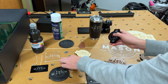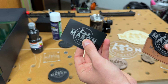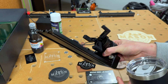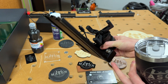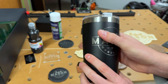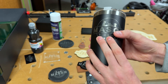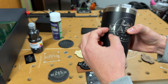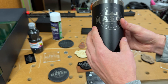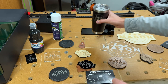Wrapping up some of the S1 examples — here's a metal business card. It has a coating, so you're basically removing that coating. The same applies using the rotary attachment: it's the same RA2 Pro that works on both of these lasers. You can get really nice results, but you're essentially etching away the coating on these cups. If you had raw stainless steel, you're not going to be able to touch that with either of these lasers. But when it comes to coated items — whether it's a Yeti or similar — you can get really good results from both.